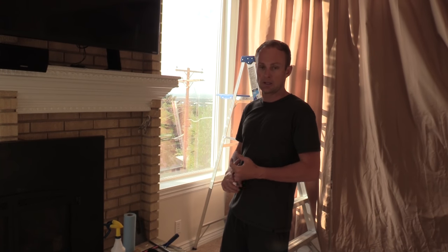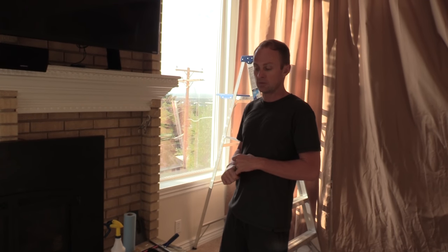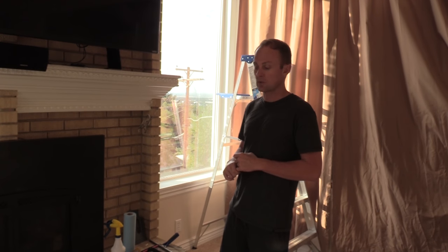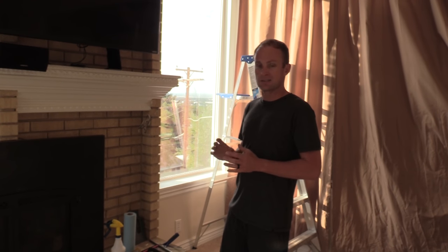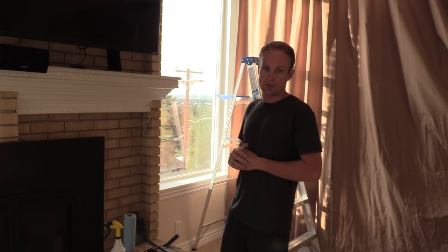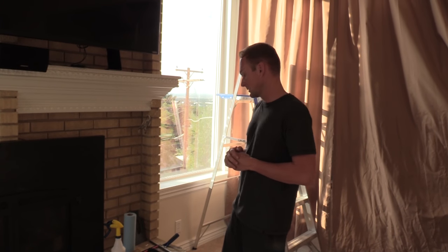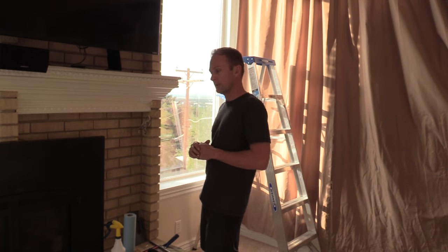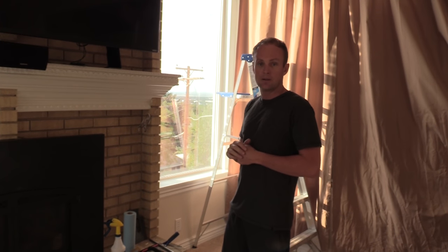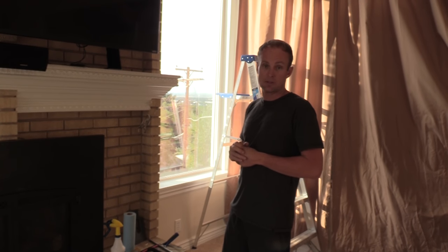This film is going to cut 99% of the UV rays. A silver reflective film — generally what I recommend is a 35%, which is safe on most homes. It's going to cut 60–70% of the heat and 60–70% of the solar energy, and about 50–65% of the glare. So it can help you out quite a bit on heating and cooling. It'll give you a little privacy from the outside, but from inside the home you'll see right through it. Most of these films last 10–20 years.